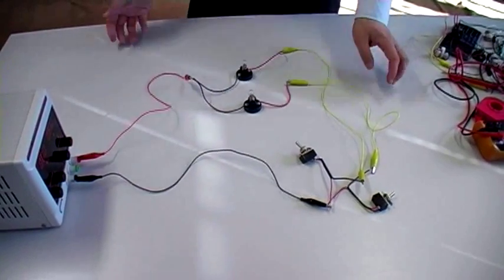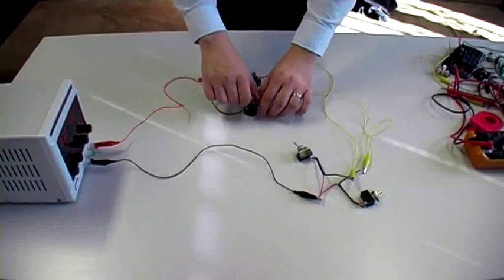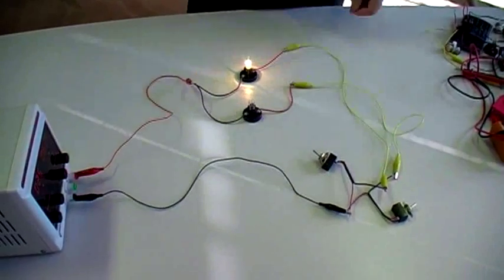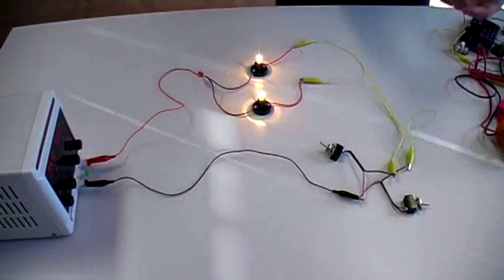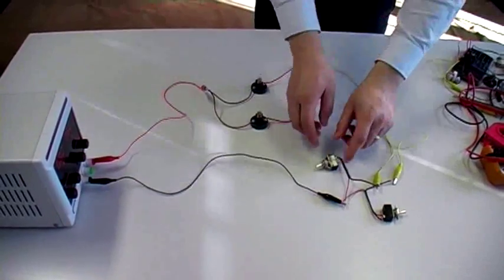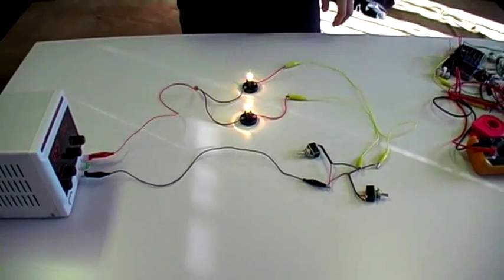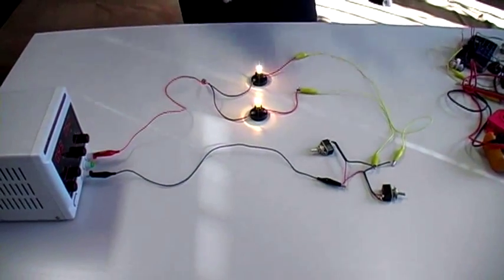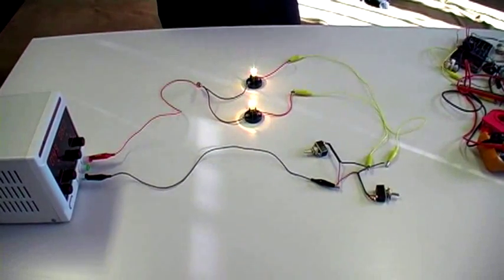That's one very important feature of household circuits: the placement of the switch. The switch is always on the active side of the AC — same with power points, same with everything. Only when you turn it on does the voltage flow through the light bulb. Notice it's in parallel: when I switch one switch on, one light turns on — that's probably one room. In the other room, I turn it on, it's on. They work independently; I can turn one off without affecting the other.